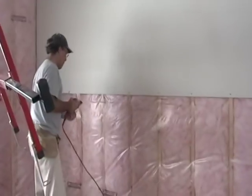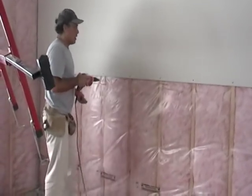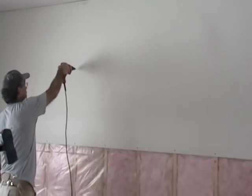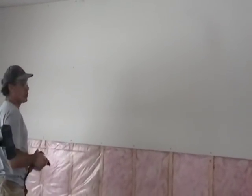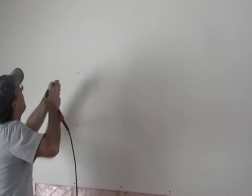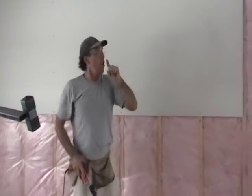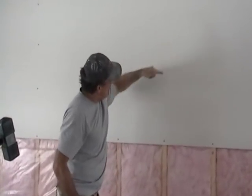After I have my bottom secured on exterior walls, I do the same as the ceiling: in each row I take the halfway point, put a screw there, then split those two in half. It's because we're pushing against insulation that we put three screws to these walls. When I go around and start doing interior walls that have no insulation, I'll only put two screws — just pick a spot here and a spot here, and two screws in that four-foot span will do the trick.